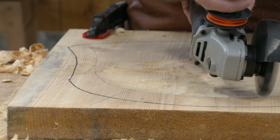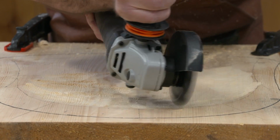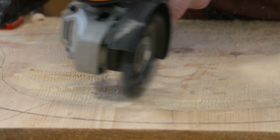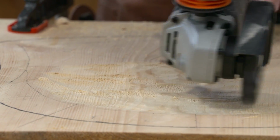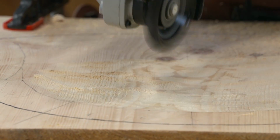As you can see, the Turbo Scraper is used on edge, and that really helps refine the seat, especially on something like this chair, because that curvature is helping bring in that shape. And you can clearly see the difference between that turbo scraped surface and this surface from the turbo plane.